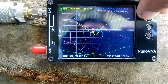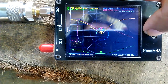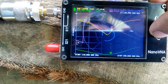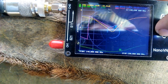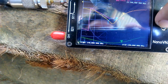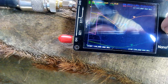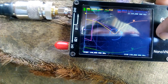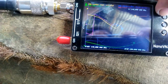Checking 144.5 MHz — about 1.04 SWR. At 145 MHz, we get 1.0. At 146 MHz, it's 1.16. At 146.5 MHz, it's 1.28. At 147 MHz, it's 1.44. At 147.5 MHz, it's 1.62. And at 148 MHz, it's 1.82 SWR — so the antenna is still usable across the frequency range.